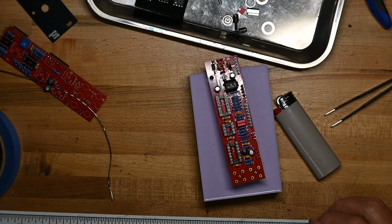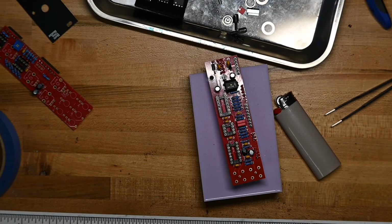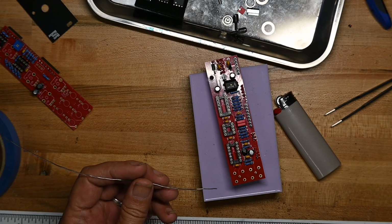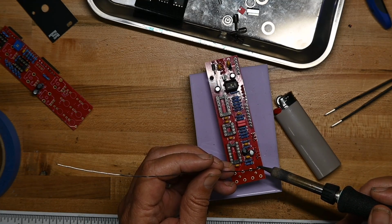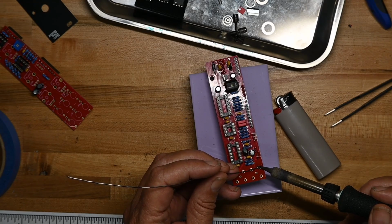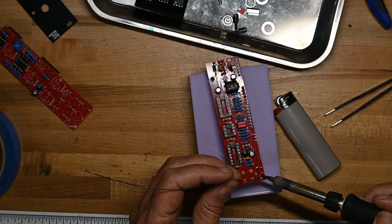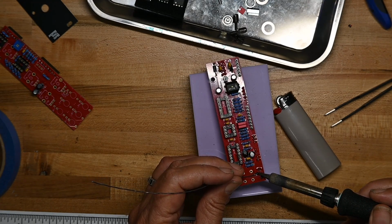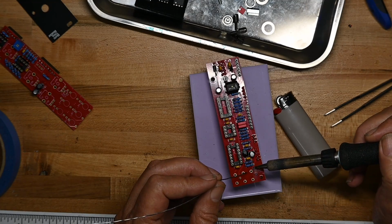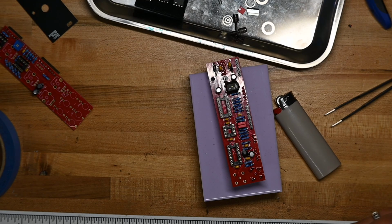As always, these are sockets, so don't skimp on the solder. That's the mechanical connection that's going to protect this from coming loose as you connect and disconnect the tank over the years. So use a bunch of solder. I think I only have one RCA cable made up. I'll have to make some up.